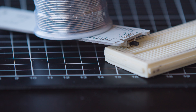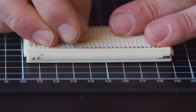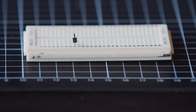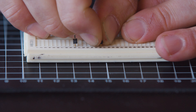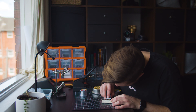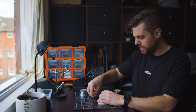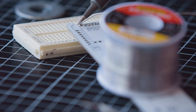The first pins I'm going to put in are the single pins — they go right next to the power switch. These ones can be a little bit tricky because they are single pins and they like to wobble around, so just make sure when you're putting them in they're going in straight. I'm going to use the breadboard for this. There's about five pin spaces between the two pins and then they should line up together. I'll prop up the back, put some weight on it, and solder the pins in.